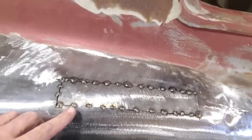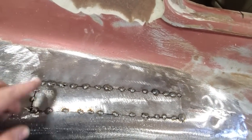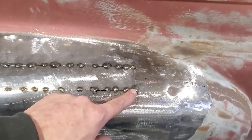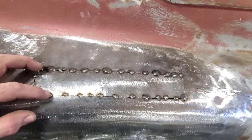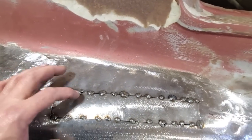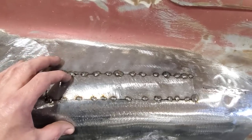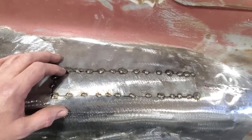Now you just saw me doing the spot welds along here and then cooling it off, and then after cooling off, going on and doing the spot welds. One thing you've got to realize, you can't just do this side here and then go up here and weld this side. I've always had a guide of about 1.5 to 2 inches all the way around the weld, okay? So if I was welding this one here, everything around this section is getting affected by it. The heat transfer is going right outside here, so this side here is getting heat transfer.